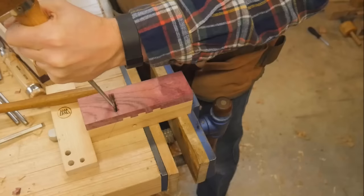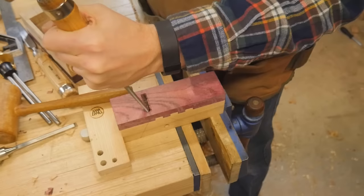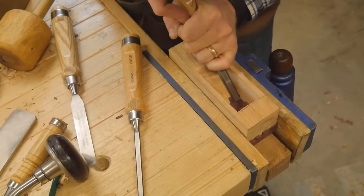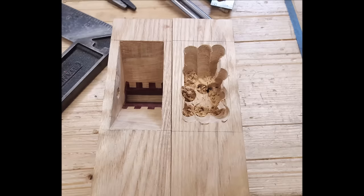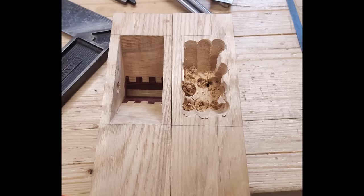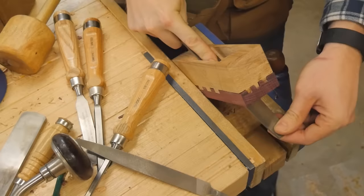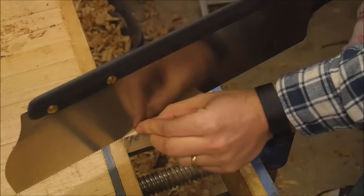Once I got down to the purple heart on the grooves, then I flipped the plane over and came at it from the mouth side, trying to remove the waste from that. And again, it's just slow bits — just take off a little bit at a time, don't be in a hurry, and you'll end up with a clean process. Rushing work is often the worst. Keeping the chisel flat to the bed, I can make sure I have the exact same angle going all the way down. You want to make sure that the bed for the iron is nice and smooth and flat. Then once it's pretty close to where I want it, I take the file and smooth everything out. This will give you a nice flat surface and a good reference edge for everything else in the future.